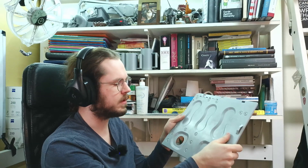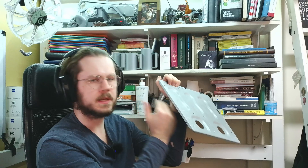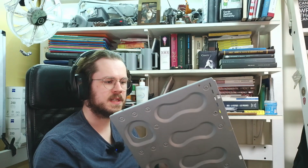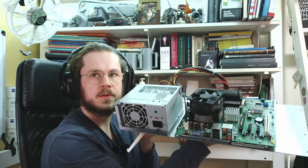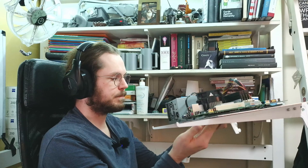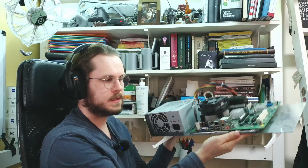I had to drill, disassemble, and Dremel everything that was too big to fit on my aluminum plates. Then I'd drill holes into the part in contact with the aluminum plate, screw everything together, put the motherboard on top, and put it in the DIY server. A huge amount of work — roughly two hours per computer. It did work and I assembled a total of five computers that way; you can even use the original screws of the computer case.